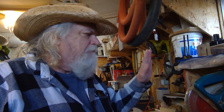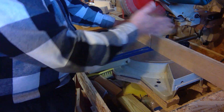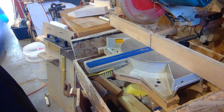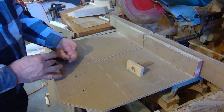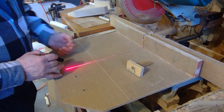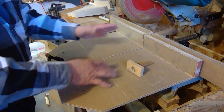So I can cut the angle in two different directions at the same time. When I use the small parts table, it just goes right in here — the fence comes off, the bolts go in and I fasten it down right here. I use this laser to do my cutting, and that works out okay because the blade and the miter saw always stays at 90 degrees when I'm using this table.